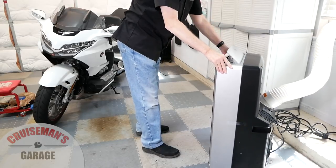I like this unit — I think it's going to work out good for me. Now, I know when I say 80 degrees that sounds hot, but 80 degrees is tolerable in the summertime. I did not expect this air conditioner to get the garage down to 68 or 72 degrees. I knew I was stretching the capabilities of it by bringing it into a garage that's partially not insulated. I can insulate the ceiling, and I probably will in the future, and that should help quite a bit. I may also put some film on the windows to help keep some of the sun and the heat out. That should help also.